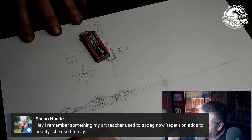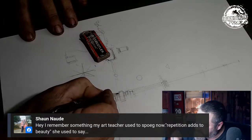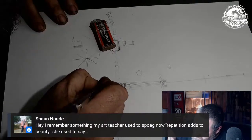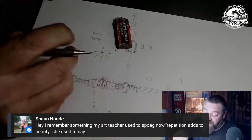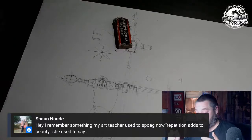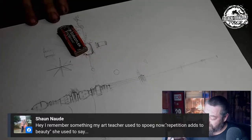take a little checkering file and go and do little teeth around them. But now you need to take into consideration how broad the checkering file is, and that there is still the same height as that. So you will need to come in at an angle, and you're going to probably bump this thing here, which is going to mess up. So rule one is don't mess up, right? So you might have to go in with a triangle file and file each and every one of those. So thinking about the limitations of your tool and your actual skill, you end up dropping a lot of detail. But that's kind of the idea that I'm going for here.